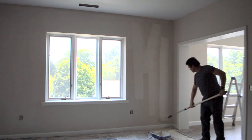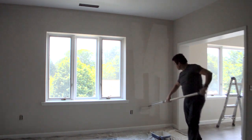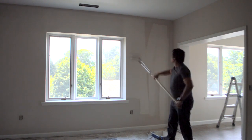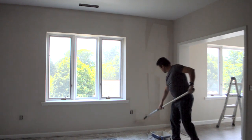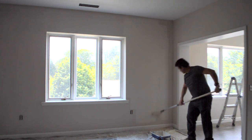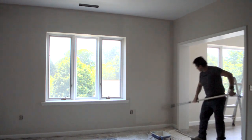An important thing is that I'm applying the paint away from the window and away from that edge, because I don't want to leave a lot of paint right next to the edges — I know it's going to be thick. Especially near windows, you want to make sure you can thin that paint in a nice way. And you don't deal with paint dripping with this technique.